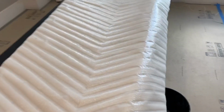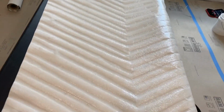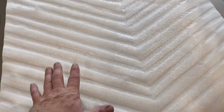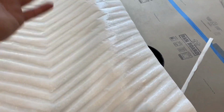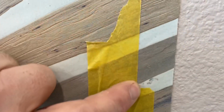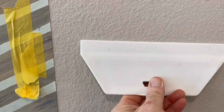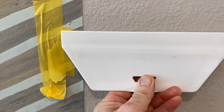My paper is tacking up. I'm not going to do a task like this without having first gotten the process of the glue soaking into the backing. So I come over here and I take 2 measurements. One is 1 inch from the edge and another is a 1/2 inch from the edge. Make believe this is my next sheet. My next sheet is going to overlap this sheet by 1 inch.